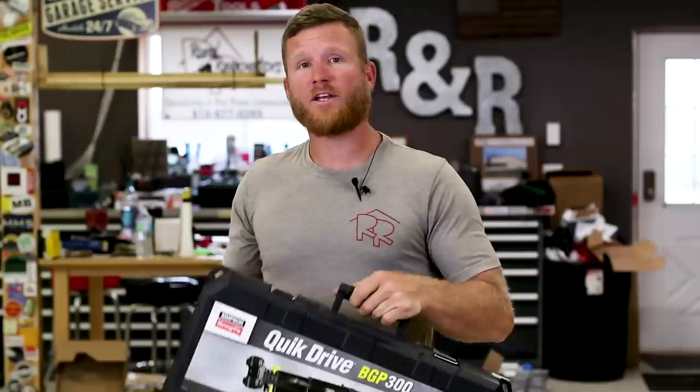This is not a review video, but here are a few specs: it drives anywhere from a three-quarter to a three-inch screw, does 25 screws at a time, and you've got about 10 color choices from Simpson. The boxes of screws with shipping cost me about $70 for 500 screws. By comparison, a bag of 500 screws from my metal supplier runs about $40. So it's definitely more money for material, but I'm hoping the efficiency, labor savings, and just the peace of mind — not dropping screws, not bending over — more than make up for that cost difference.